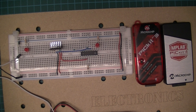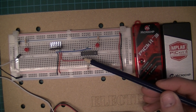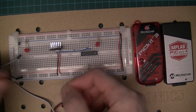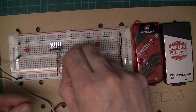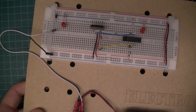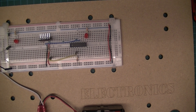Then I got another email. The suggestion was: also please try a 100 ohm resistor in series with the MCLR line. I'm not going to mention the guy's name, but he's suggesting to add a 100 ohm resistor there. So let's do that. Normally I'd be trimming these legs down, but it's good enough for now. Basically, instead of going straight from pin 1 of the PICkit to pin 4, I've now got a series resistor.